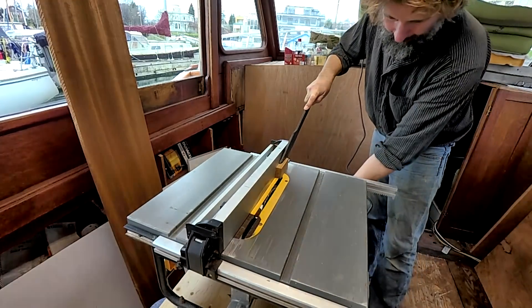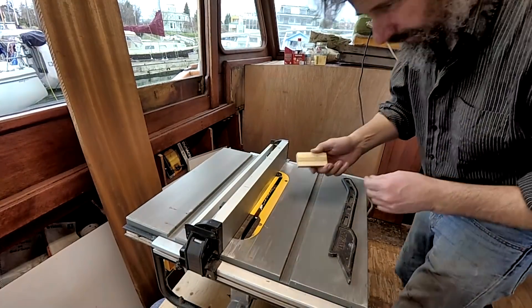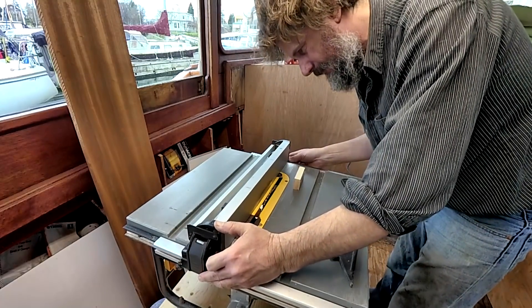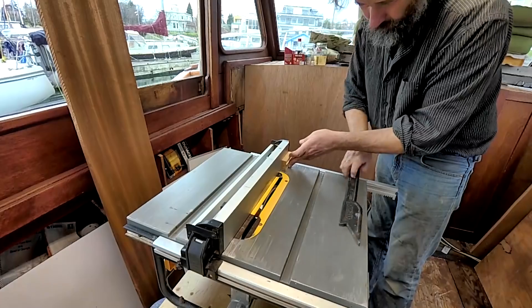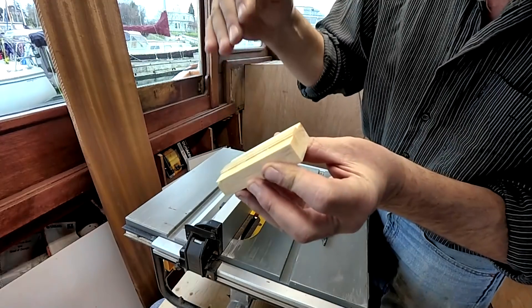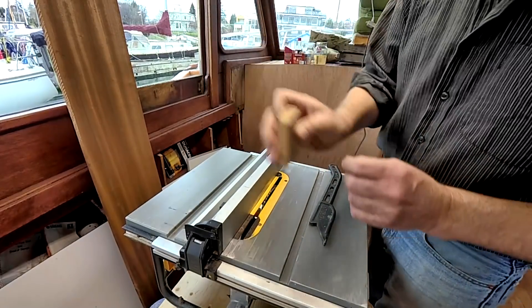Let's see how this goes. It fit perfectly in the groove. Now I want to widen it a bit because that's not a very deep chamfer, so I'm just going to move this over a bit and take a little bit more off. I've made two cuts, basically to create a step — a simulation of a chamfer to sit in the chamfer. I think I'll actually set the blade over at 45 degrees because it sits in relatively well but I'd like it to really sit in snug. I'm going to play a little more here.